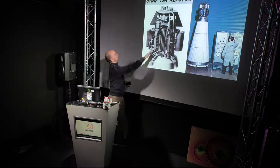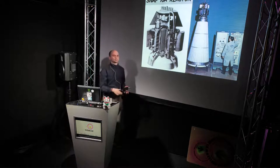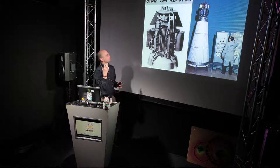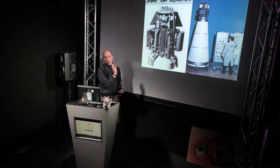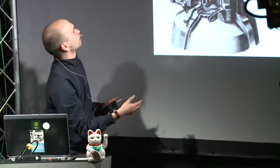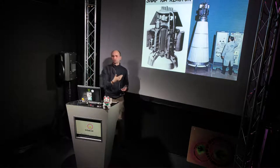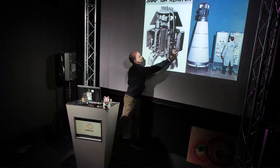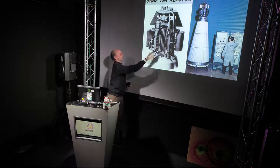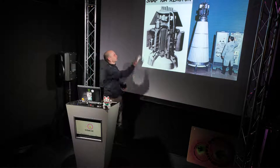The pump itself used about one third of the power, or something like that, or one quarter, something of that size. And you can actually see how the whole thing works, because this here is our neutron reflectors. Chain reaction inside the reactor releases neutrons in all directions, and of course it's used within the fuel pins to split other atoms. But some of the neutrons escape. When you have them like this, and they are open, they leave gaps, and a lot of the neutrons can escape. And then you can move these things around, and they will not leave gaps, and more of the neutrons will not escape and just come back to the reactor. And that's how the whole thing can maintain a chain reaction. And you can use this to control the reactor.